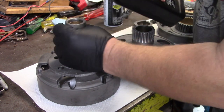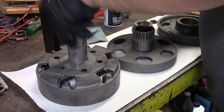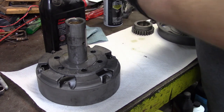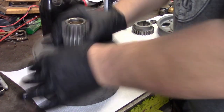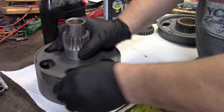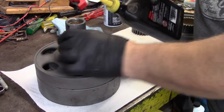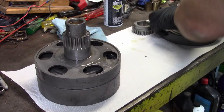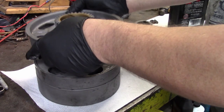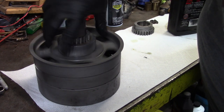Let's put the drums together. We're going to take a little oil — these have all been bead blasted. I coated them with fluid film and have since rinsed that off. We'll coat the shaft and the surface here and put a little on the bushing itself. It struggled a little going on — a little tight at the top — but you can see it spins nice and free, so that was a good one. Oil up the other surface, put some lubrication on the back, slip that one down. There are the three drums together and looking good.